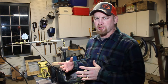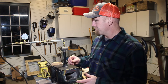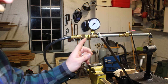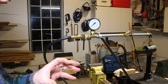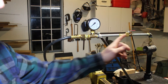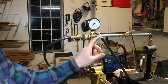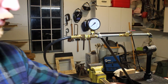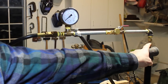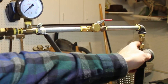I'm going to bring you in closer and show you this in more detail. You can see it's all put together and I used the yellow propane-rated tape at all the joints. I also have a bracket here that helps support this cantilevered section with the pipe hanging off. I used a pipe clamp and welded it down onto the side of my forge — that really helps reduce stress on the small piece of copper piping at that union.